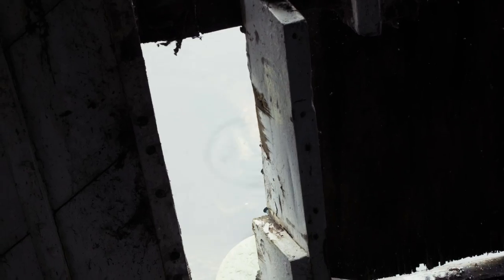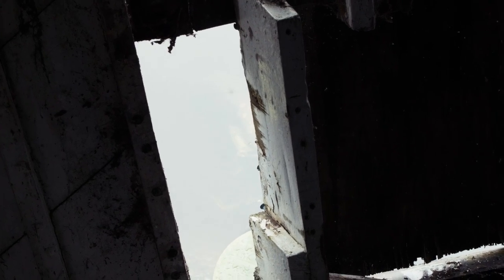There's a few that have to be replaced, and we also have to get some because there are obviously missing ones there. There's a lot of dry rot in the hull. At least it's above water level, so that's not an issue. Well, not so much an issue. It could be worse. Going to put in a lot of wood hardener to really harden up that damp timber, the stuff that we can't get at that's below water level. That'll solve that problem, and then get paint on that.